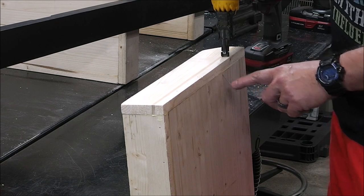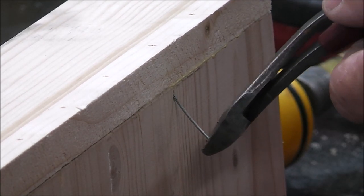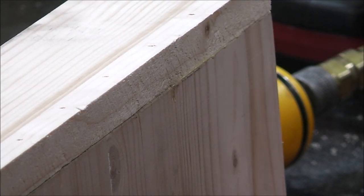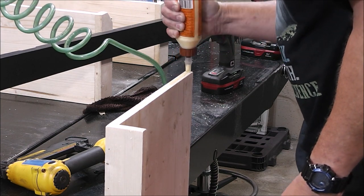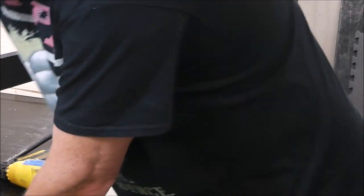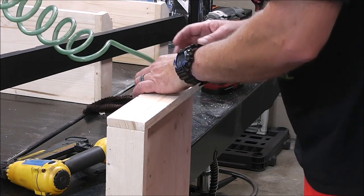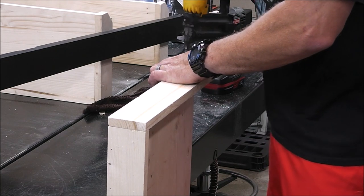Look at that — see it shot right out. Had my finger been there lining that up, it would have gone right through it. It doesn't just have to be needle nose pliers either — you can even use side cutters. The motion is just the same, back and forth, and it breaks off below the surface every time. That little trick has saved me a bunch of times, especially doing window and door trim. When you're putting on your last piece of trim and you shoot a nail out through it, you've got to figure out a way to fix it without causing a whole lot of disturbance.